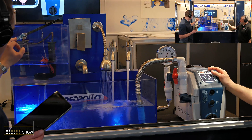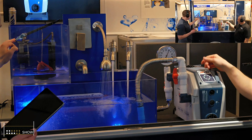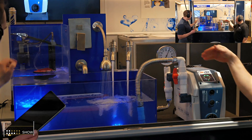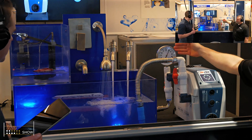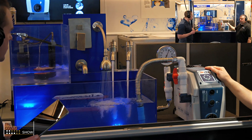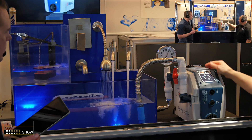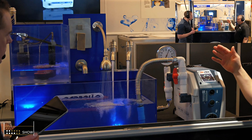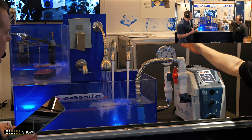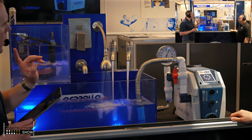What happens when you're in the shower and someone flushes the toilet — we've all done it, accidentally or on purpose? The pressure just gets maintained. The pump is now running at full speed while still maintaining 60 PSI. This is a great installation for situations with low city water pressure that might fluctuate when someone flushes a toilet or turns on a faucet — this will maintain that pressure constantly.